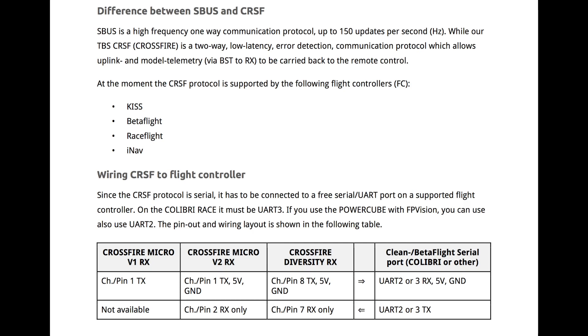It's pretty different from S-Bus. I've been using Crossfire for a little bit, but I was on S-Bus as well. One day I was sitting around thinking, maybe I'll just make the change. What's great about the Crossfire Protocol is it uses a much faster connection. I think 150 Hz is the maximum you can get with Crossfire on S-Bus, and the Crossfire Protocol is four times as fast as that — a lot less latency.